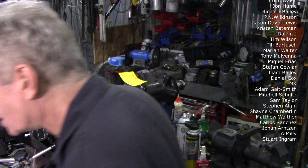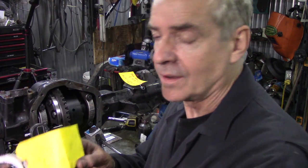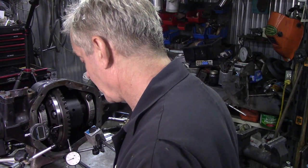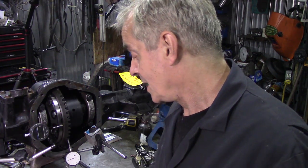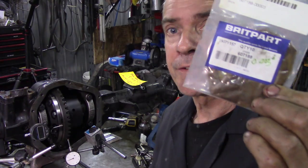So what we could actually do - I think there's some shims here. Look at that: 0.003. So if we were to put two of these shims in tomorrow, and then on the other side we want 0.059. These are 3 thousandths, so if we've got one of these on the other side plus 9, we should be absolutely on the money. We've got 3 shims - we could take 3 shims out of these 0.003 and that should be absolutely spot on.